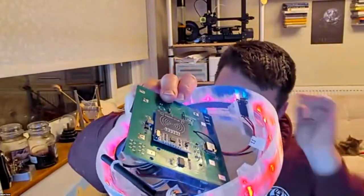The reason behind that is because the 8266, I had a lot of problems with the quality of those. I had them not flash properly. I had them just randomly corrupt themselves. I had so many problems. Whereas these ones, they're smaller, which wasn't actually a factor in this. But most importantly, the EEPROM is built onto the Espressif chip, which means that it's decent quality. So hopefully a bit more reliable.